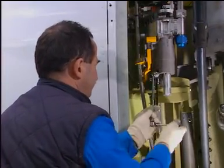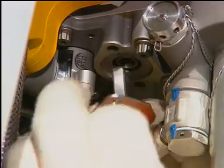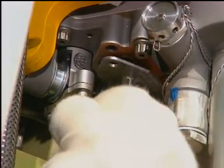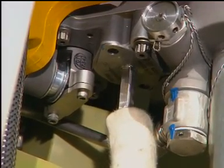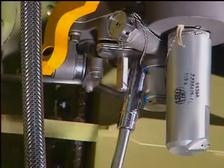At each center drive unit, remove the CDU lockout plate, invert it, and reinstall it with the square drive away from the drive pad. Torque the bolts to the appropriate value.